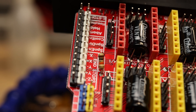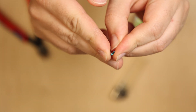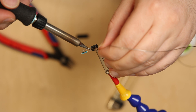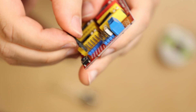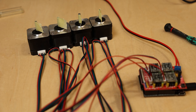The solution is to simply remove the pull-up on the CNC shield and connect the enable pin to ground via a pull-down resistor. I bent and soldered a 10k pull-down resistor to a socket header to act as a jumper for the ground and enable pins on the CNC shield. After these modifications, the board boots and the motors work perfectly. All four motors move independently and are controlled via Telnet over Wi-Fi. If you like this video, give it a like and subscribe while you're down there.